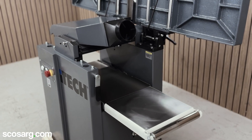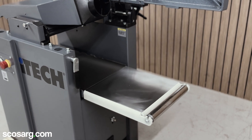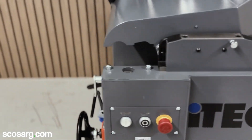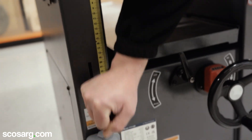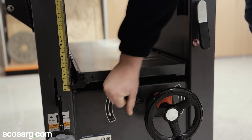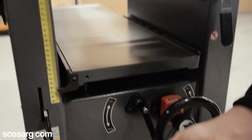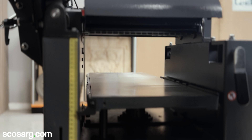Accompanied with the massive 1.4 meter tables across the top, you get an extension table for the thicknessing bed, making it easier for you to put longer pieces of material through. Walking around to the front of the machine you'll see all of the mechanical adjustments: a simple handle for turning the feed wheels on and off, a locking handle for the thicknessing table, a mechanical readout, and a handle to turn it up and down to whatever desired thickness — accurate to within a tenth of a millimeter.